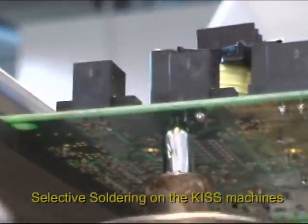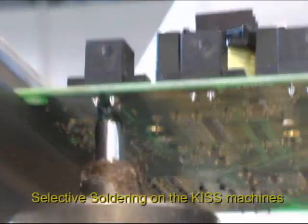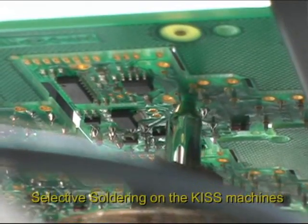You can personalize the time temperature profile — that's the time that the individual pins are under solder — to achieve full barrel fill and topside fillets.